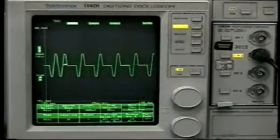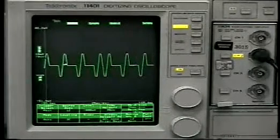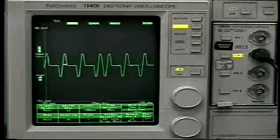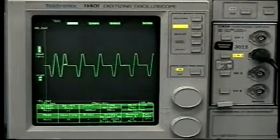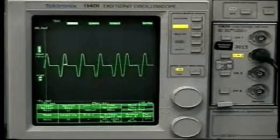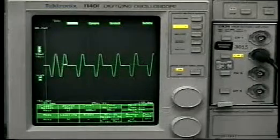The SCRs only turn on or turn off as the sine wave passes through zero. As the input command signal increases from zero to 100% power, the number of AC cycles on versus AC cycles off also increases.